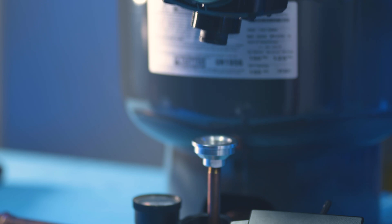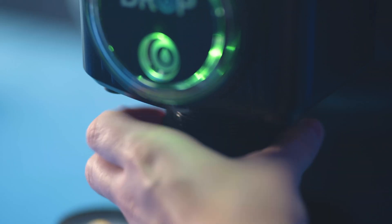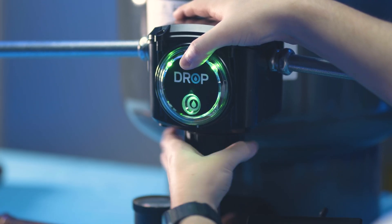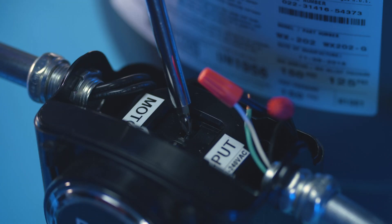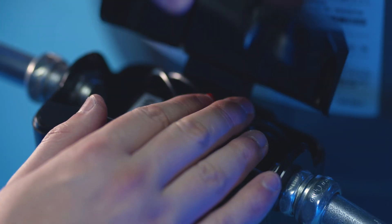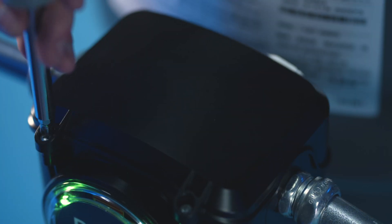Instead of trying to get a pressure switch on perfectly in the right direction, the Drop pump controller comes with a union connection so it can be installed or serviced without spinning the complete switch like an old-fashioned one — just push it together and snug up the retaining nut. It also has plenty of housing room for field wiring of the power input and output connections. The system uses a 25-amp serviceable contactor that can be manually operated, ensuring many years of durability and peace of mind for both the installer and the end user.